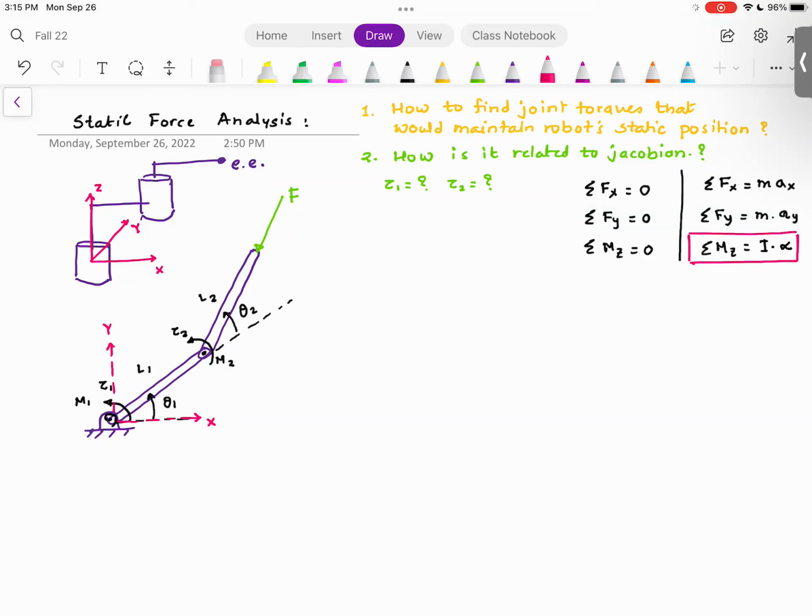So here is the difference. And I want to emphasize this because this is not emphasized when you study statics and dynamics. Summation of forces is equal to mass times acceleration is valid on the entire body. Summation of forces in x direction, y direction, z direction will always be mass, which is the scalar quantity, times the acceleration about that direction. Translational acceleration. Everyone agrees to that?